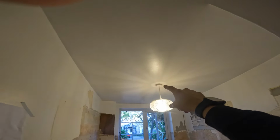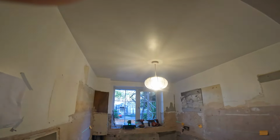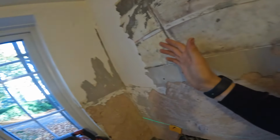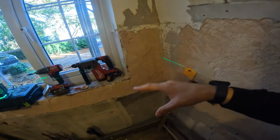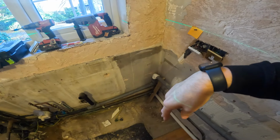So we've also got some downlights going in here, so I want four downlights. So I can take that, extend the cable to 1, 2, 3, 4. Yeah, we found out that yesterday, so we want these to land in front of the cupboards. So the cupboards will be like 300 mil cupboards depth. So I have to make sure, but sometimes you get 600 mil, so you don't want to land your downlight above your cupboard, do you? So I have to come off there and then have your downlight start and then copy it all the way around so it's nice and equal. So yeah, we've got the downlights to go in then.